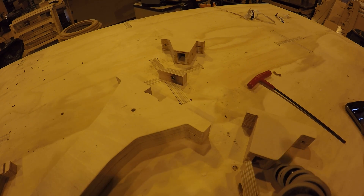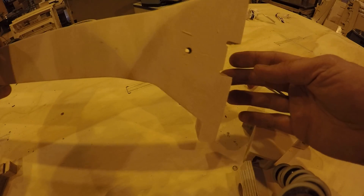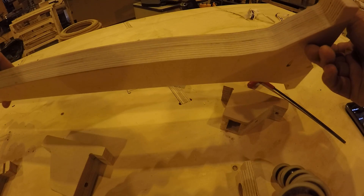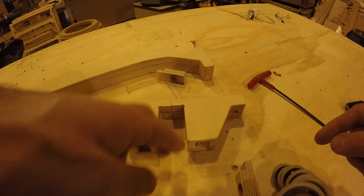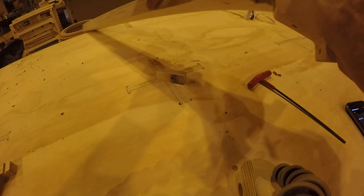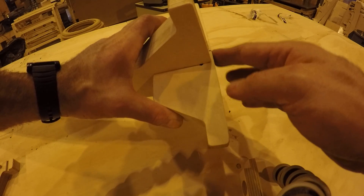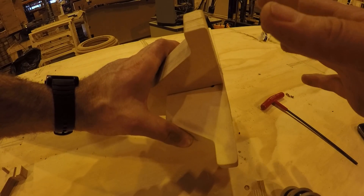I thought I'd walk you through my OpenDesk cafe table hack here. This is a leg for an OpenDesk cafe table, and the original design had this sort of one-piece leg — it's double laminated plywood — and the second piece was a single piece that had a male insert, with two pockets milled into the end. You basically take this piece and insert them together and glue it together. Now that wasn't necessarily a bad design, but it did depend on getting the plywood thickness just right so you have a good tight fit.